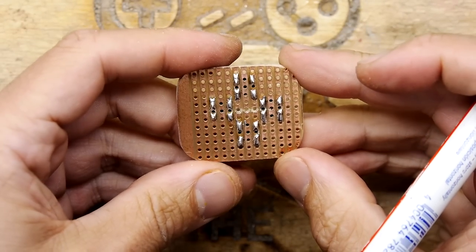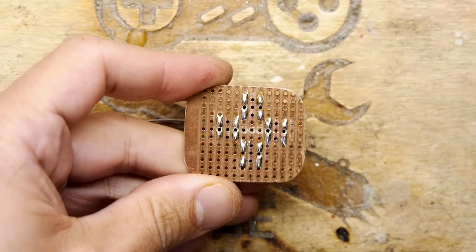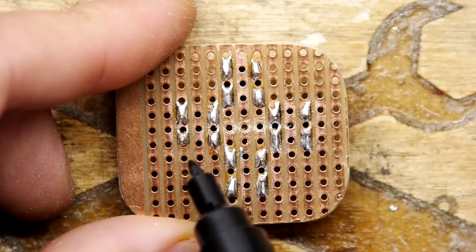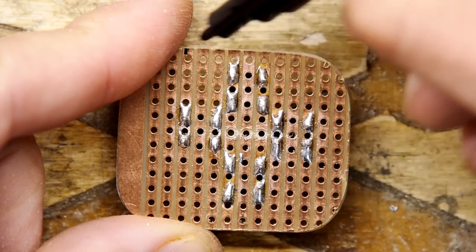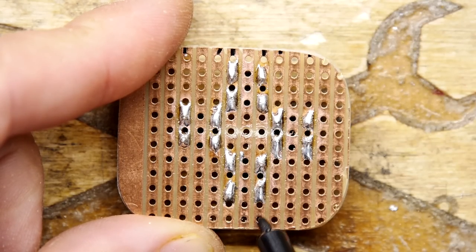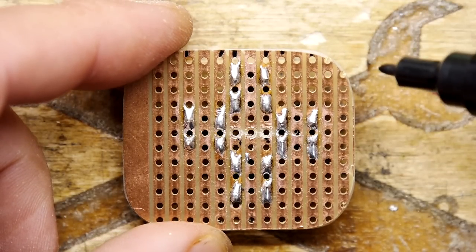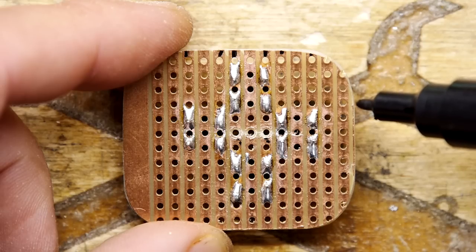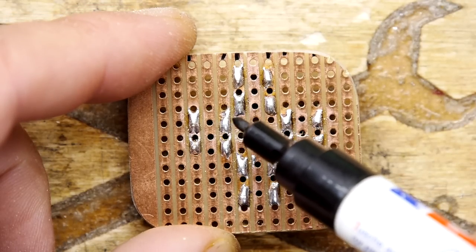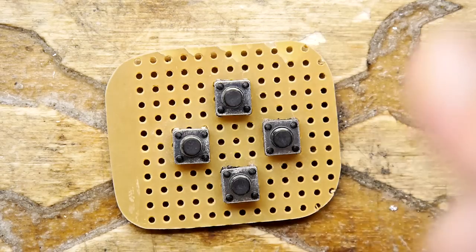Here's the end result - I've tried to tidy up the board. I've made a cut through the Veroboard in the middle, separating the two switches that are in line with each other. You've got two pairs each: one switch here, another here, one here, and another down here. Because it's all common-grounded, you can work out a way to ground a bunch of them - ground those two there, ground those two there, then join those together as your common ground.